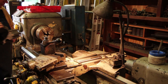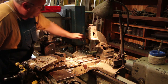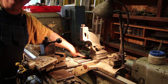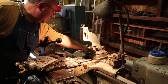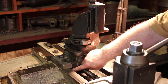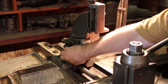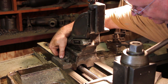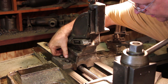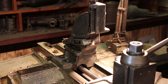This piece fits back here onto the dovetailed ways and you bring it up and clamp it down. There's a gib on the bottom of this dovetail that tightens up when you tighten the screws. This side is dovetailed in and this side is square, but there's a dovetail gib down here. When you tighten these screws it tightens the dovetail on the bottom and basically clamps this piece in place. I'll do it thumb-tight for now and get our piece of metal in here to figure out exactly where we need to place it.